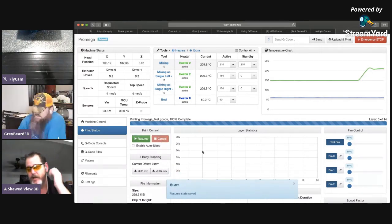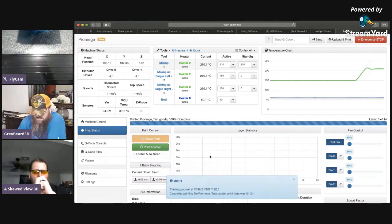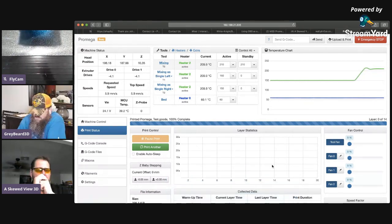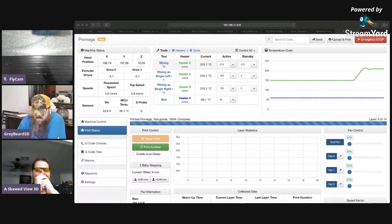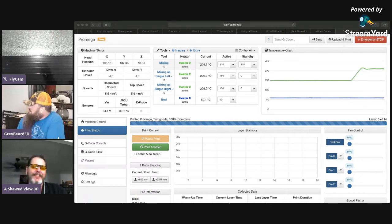When all else fails, unplug it. Yeah, I get you. Okay. Why is it moving so slow, man? What did you have the speed set at? I don't know, you think I paid attention? Dude, I'm too broke to pay attention. Print settings, speed. Let's see. It says 60. That was not 60, dude. That was maybe 16. Look how slow it's moving, even now, when it's trying to home.